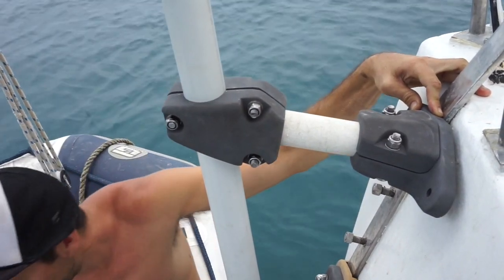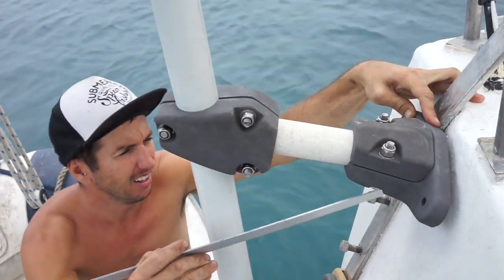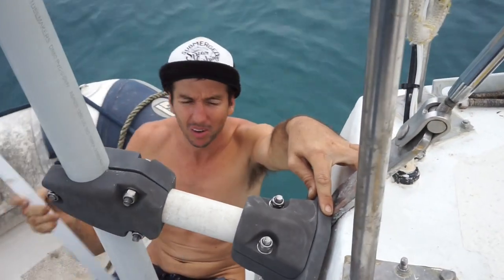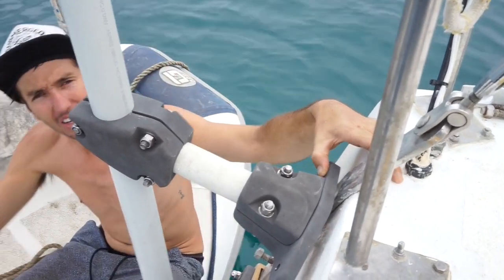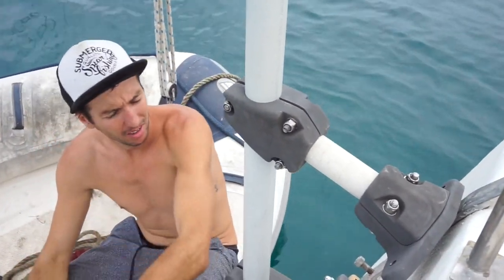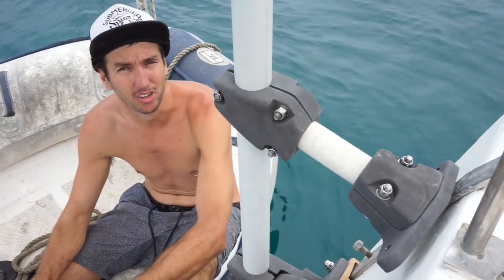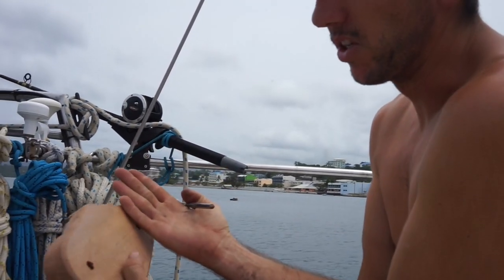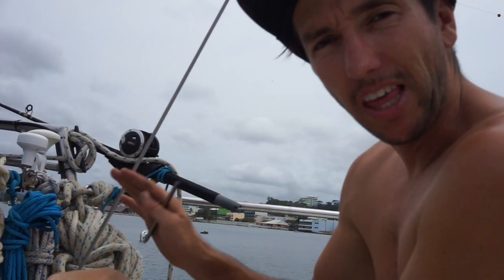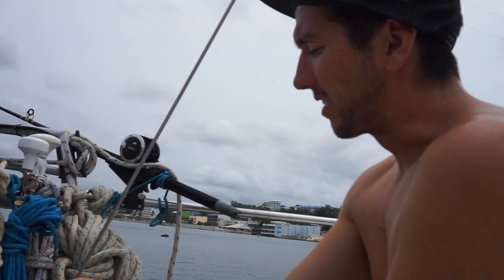So that'll sit good, but we need to get this wooden plate under here. 13 mil shaved off that edge. So we have to contour that 13 mil off one side, to somehow slither a few degrees of it. So we need to chamfer the face of this wood to match that angle, because this top bracket doesn't have a hinge. And it's at, I think, a 40 degree angle that I read.